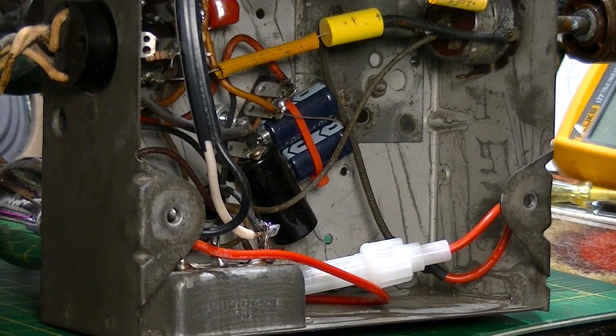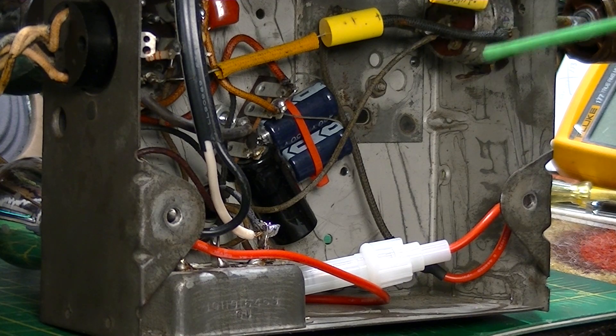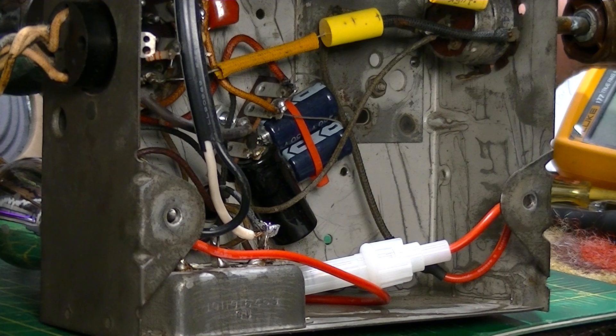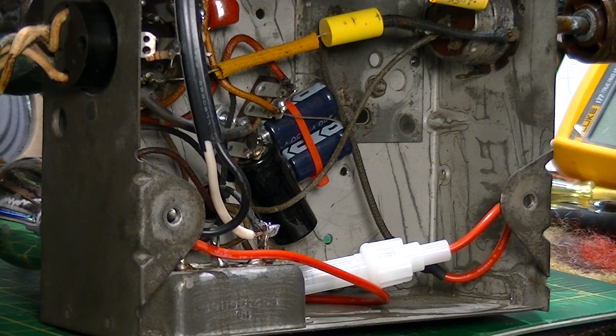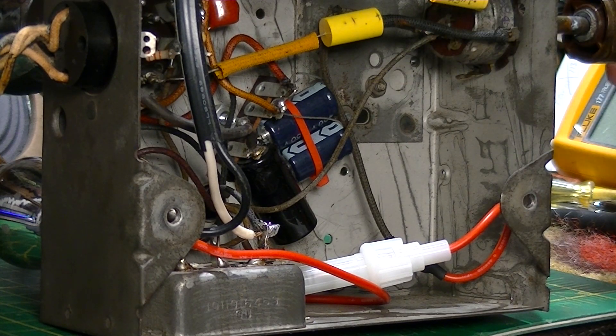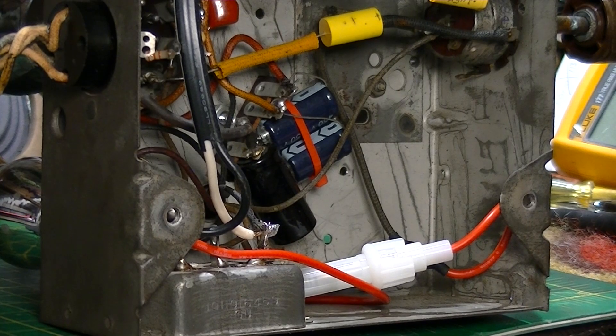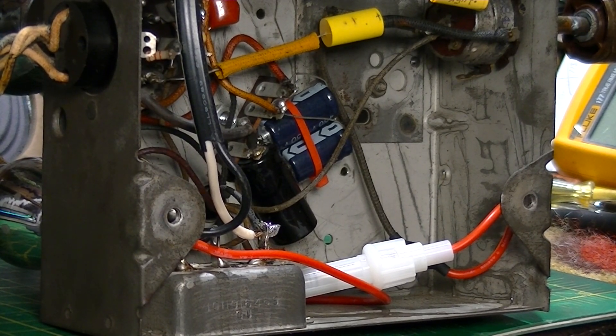I think there are micas in here. I'll check that one resistor that's back there - a sleeper you can't even see. It's sure not worth taking that coil out to get in there; I'll MacGyver it somehow. I also changed the value on the tone capacitor - I put my capacitor substitution box in there and played around to see which sounded best, settling on a different value for deeper bass. I put in a five-tenths amp fuse, secured everything correctly, changed all the capacitors and resistors that were out of tolerance, and did my alignment - but it's not right yet.